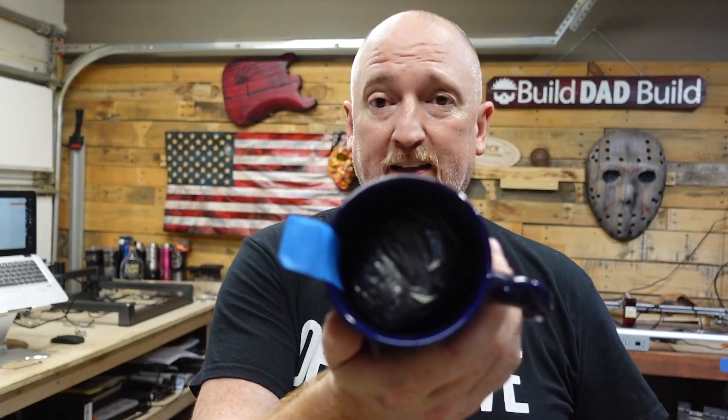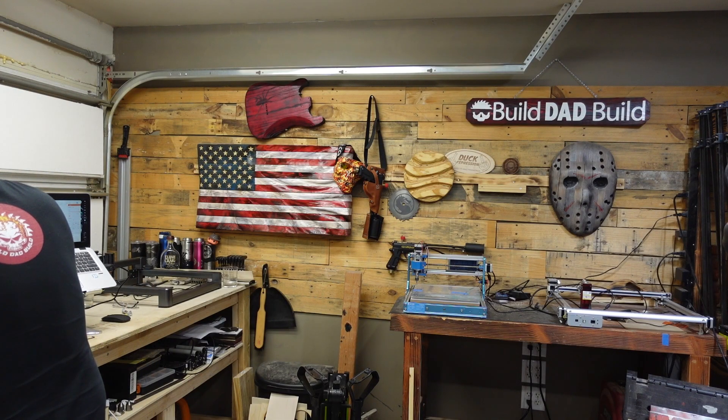So let's put everything together now. We've already slid this down. I have my mark on here so when I frame I have my reference point. I'm not really using anything for additional friction because I feel like this is good enough. We have our jig right here — patent pending. And I've weighted this. So now we're just going to drop this into the rotary. After telling you all the things you should take into consideration before you start your engrave, I actually forgot to focus the laser, so I had to stop and come back and recalibrate everything. It happens to all of us — focus, people, focus.